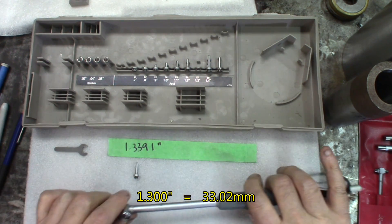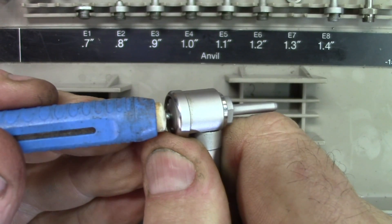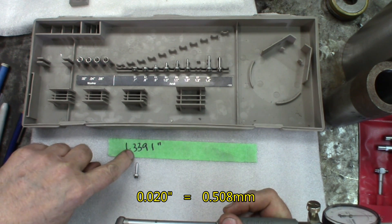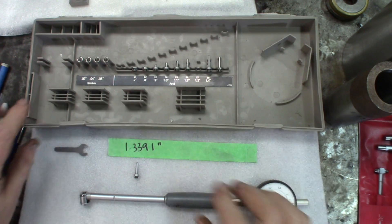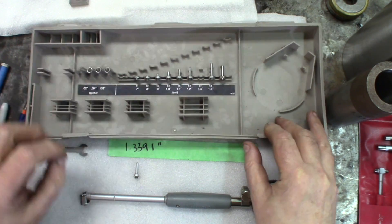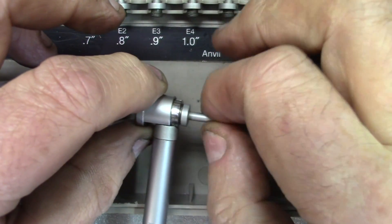One thing we must know is that if we just put this straight in there, that little retracting pin — if I press on this, you're going to see the dial goes a few rotations. This gives us a little bit more than 0.020 range. If we go from 1.3 to 1.320, we're not exactly there yet. The box here contains some washers; the purpose of those washers is to increase the value. I'm going to be adding a 0.020 of an inch washer.